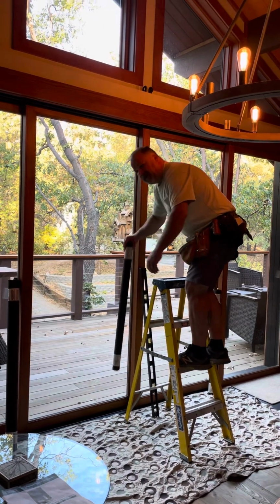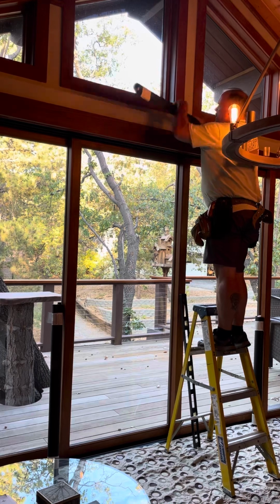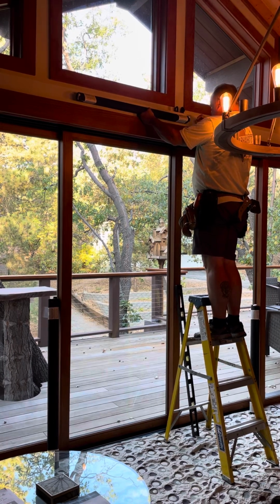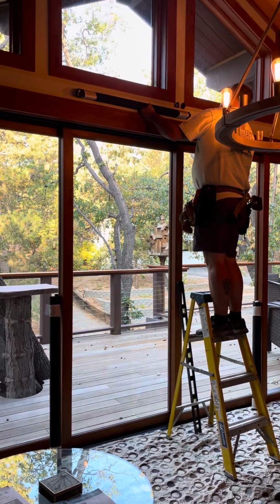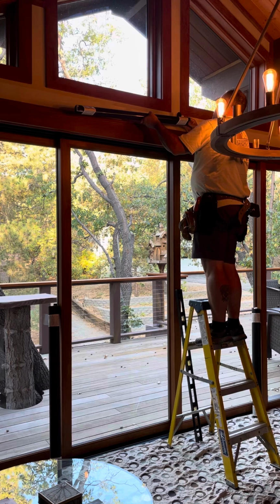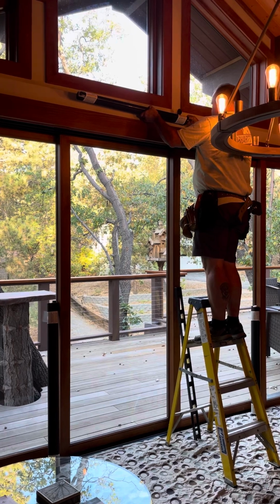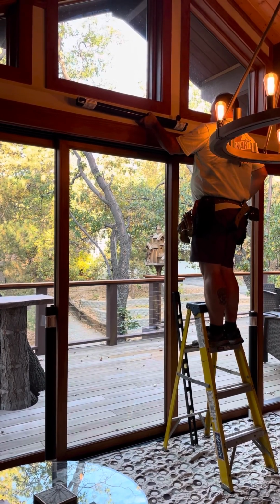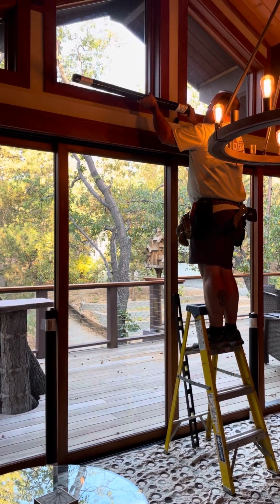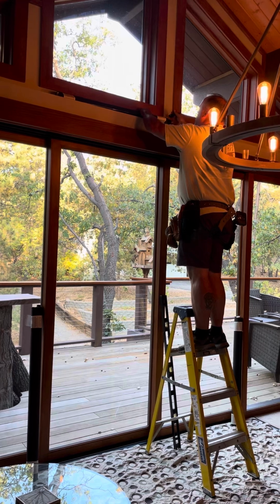So, I'm not so good at math, but I am good at seeing things. So I take the shade and I hold it up and I go, you know, looks pretty good right about there. How about we center it up right on this beam here? I like that. So, you can even take your bracket, slide it on a little bit like so, go over here, like there, put it in between there, take your trusty pencil, make a little mark on the top of the bracket. Lucky for us, they put a shelf right here. So we can put our shade right there.